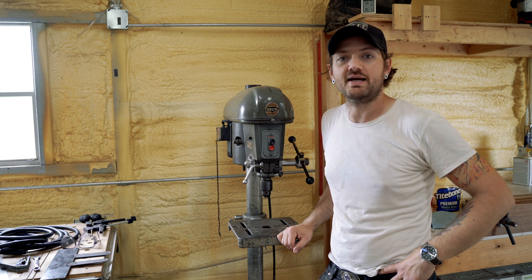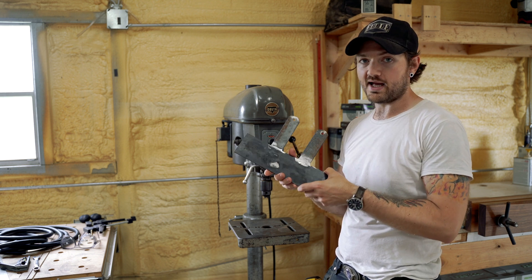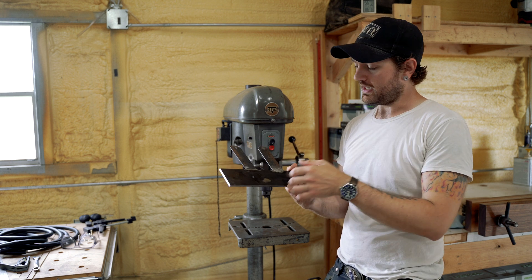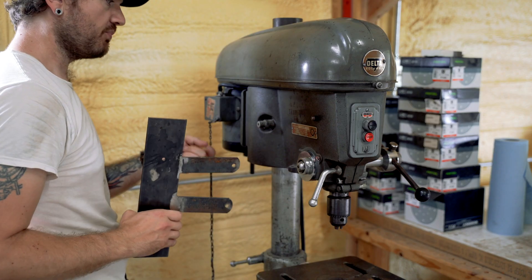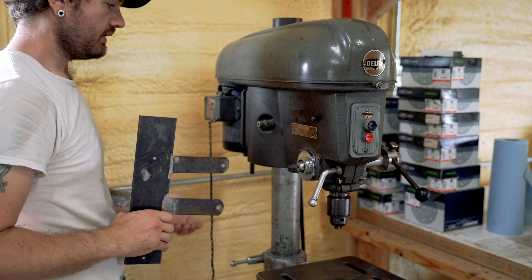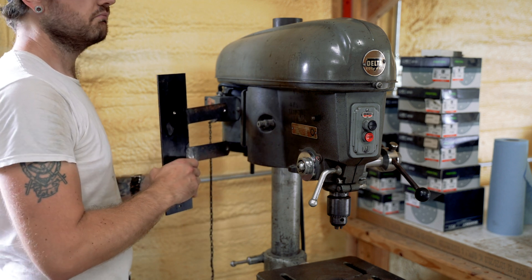They wound up leaving and I'm finally back at this. I've got my bracket made up — just some 3/16ths by 3 flat bar and some inch-and-a-half, eighth-inch flat bar that I welded together. It'll hang here, and I'll mount a light up here later. To mount the bracket to the existing motor mounts, I'm just going to use the nuts — I took the washers off because the flat bar is going to act like washers.